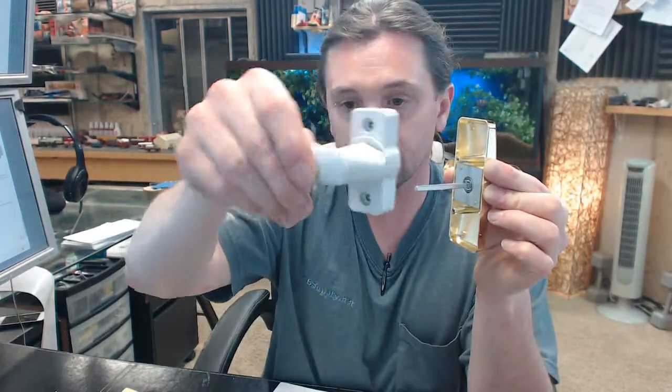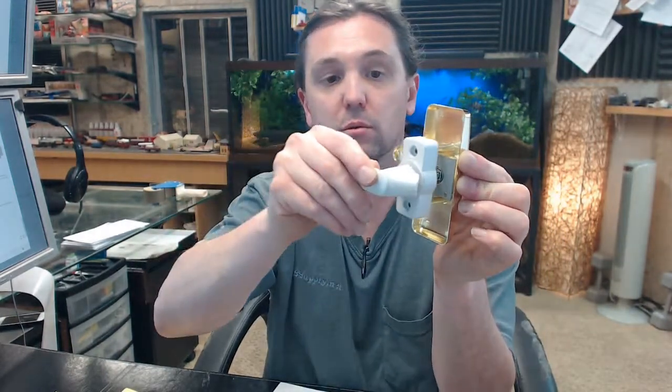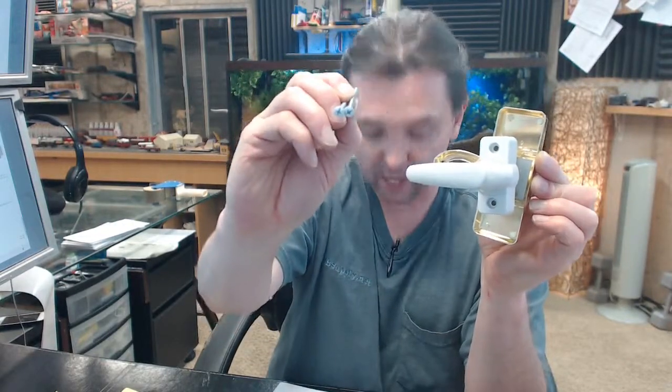Step 3. Guide this assembly through the bottom 3 holes on the outside face of the door. Step 4. Guide square spindle into the square hole of the inside assembly, which is your latch. Insert the short machine screws through the inside latch into the threaded bosses. These are called bosses. And those are indeed threaded or tapped. Okay. Those screws are these long machine screws, and they'll have a white painted head to them.